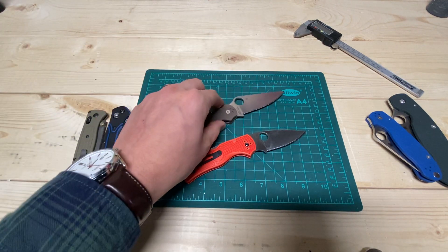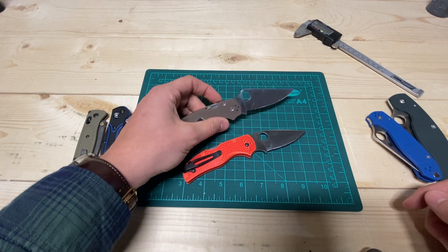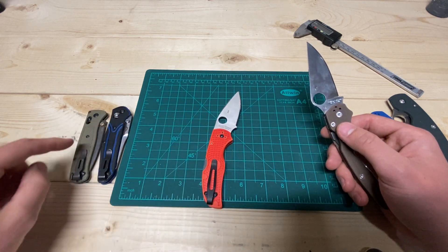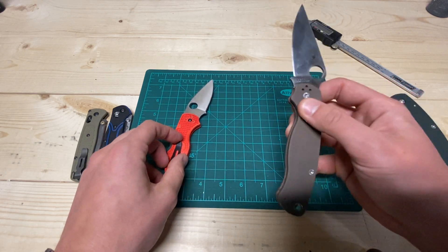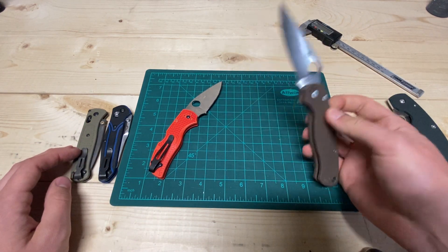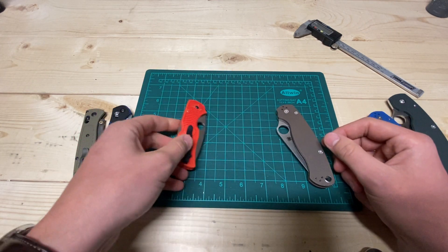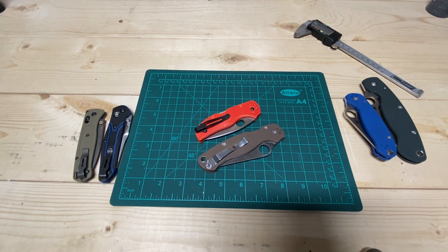So that's what I wanted to talk about. Try out that higher grit edge on these less than 4% vanadium steels. Spyderco's LC200N I'm guessing is 59 Rockwell — kind of confirmed by these two blades. And Spyderco's S35VN, they do it pretty good. I think I've seen these Rockwell tested at like 59.5, so I'm guessing this one is in the upper 59s based off what I'm seeing. They do a good job on the S35VN, and considering the cap on LC200N, I think they do a really good job there as well. That's all I've got — I hope you enjoyed it. Have a good one, guys. Bye.